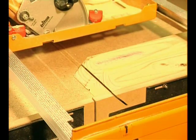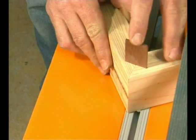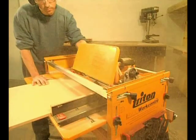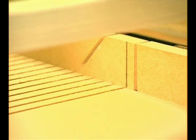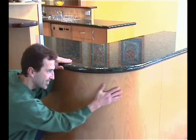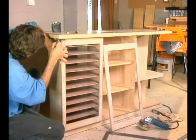By simply feeding the wood in from the other side and raising the blade a bit, you can cut a spline groove. You'd then make yourself a spline or key, perhaps in a contrasting colour, and you've got another tight, professional joint. You can even bend a piece of wood — it's called kerfing. You make a number of evenly spaced cuts, but not cutting all the way through. It takes a bit of patience and care, but it's not difficult, and the results can be spectacular. You can use it for decoration, or reinforce it and use it structurally. You'll be able to build things that right now you probably wouldn't even dream of tackling. You can make it with Triton.